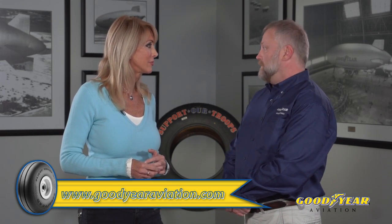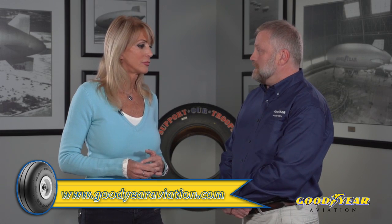Here's a question a lot of folks are asking: how old is too old for a tire, whether it's sitting in storage or on my airplane? There is no shelf life for Goodyear aircraft tires, but we do recommend that you inspect them. Pull them out of storage and use them, but you can find information in our Goodyear care and maintenance manual at GoodyearAviation.com. Look for cuts, cracks, or any kind of damage before you use the tire. Also try to use a first-in, first-out method in your inventory — that's just good practice.